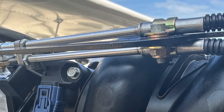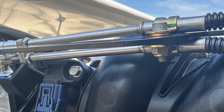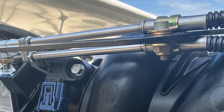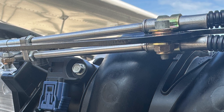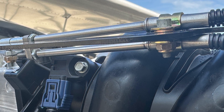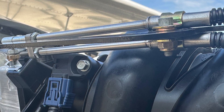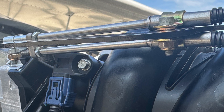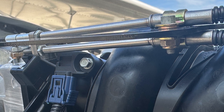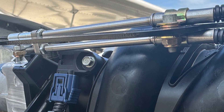It's extremely important to pay attention to all these details about throttles, because without the throttle it's just like having an engine stoppage in the air if the throttle were to fail or lock up. It's crucial that throttles are routed properly and that aircraft-grade cables are used — meaning 10-32 or quarter-inch throttles with Teflon lining — and that no bicycle-style push-pull wire throttles or springs are used on an airplane.